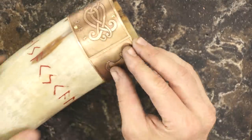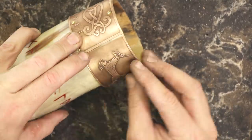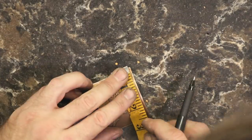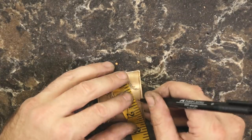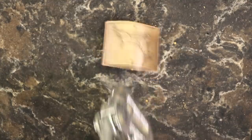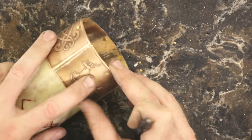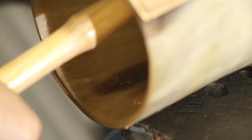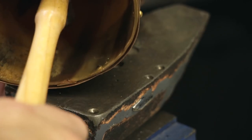Here I am lining up that first stag, and now we can see where it needed to taper. I'm going to sand that off really quick and come back and check it — there, that's great. I'm going to mark the center point, eyeball the other one, and then mark our top hole, bottom, and rivet those in place. Then we're going to go over to the other side and do the same thing, making any micro-adjustments until all three pieces are riveted on generally in the center line.